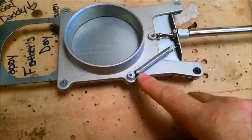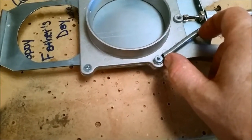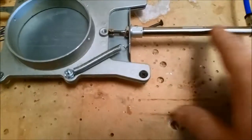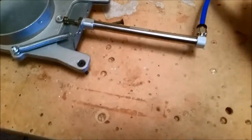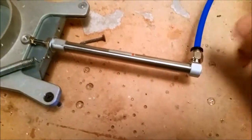I simply use a very small, about an inch-and-a-quarter coil-to-coil spring and a pneumatic cylinder to push the gate open. This is six-millimeter tubing with some basic connectors to connect the solenoid to your tubing and then on to your cylinder.